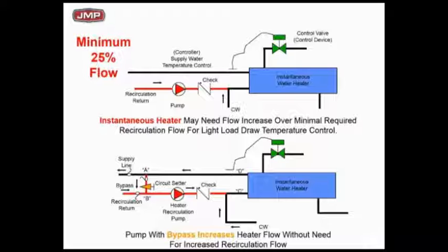The main thing you need to understand: that little green valve is a big steam control valve, sized for 100 GPM — 40 to 140°F through that water heater. It's sensing supply temperature to the building. It's not sensing GPM. It's not sensing load. It's only sensing temperature.